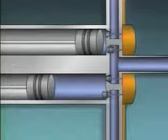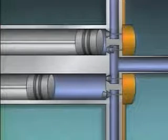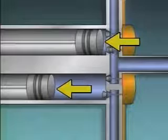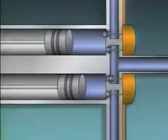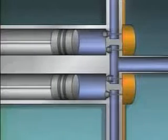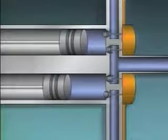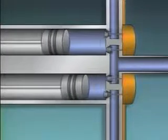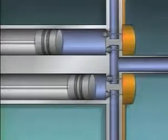To overcome the capacity limitation of a pump that has a single piston or a single plunger, some pumps have two pistons or two plungers. These pumps are called duplex pumps. This duplex pump has two pistons that alternate their movements. It operates like two single-piston or simplex pumps that are side by side. Each portion of a duplex pump can be double-acting, as in this example, or single-acting. In either case, the strokes are mechanically timed to provide the smoothest possible discharge. Now is a good time to try a question on reciprocating positive displacement pumps.